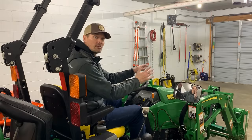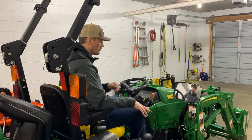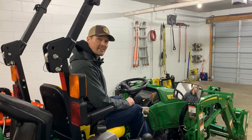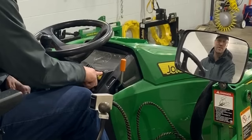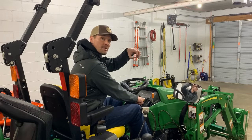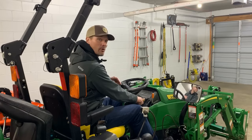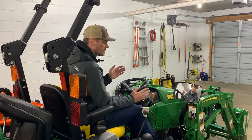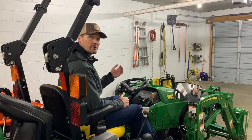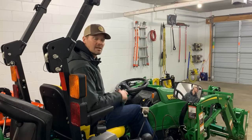So let's say you're driving forward, mowing your lawn, and you want to trim tight around a tree or landscape bed. Your foot is on the forward pedal, the mower deck's on. Take your foot off the hydrostatic pedal, then push the button all the way in and hold it — or if you have a pull type, pull up all the way and hold. While holding it, push the reverse pedal. As long as you're pushing the reverse pedal, you can let go of the yellow button and it returns to its natural engaged position. You'll then be able to back up and mow tight to your tree or landscape bed. Again, safety first.